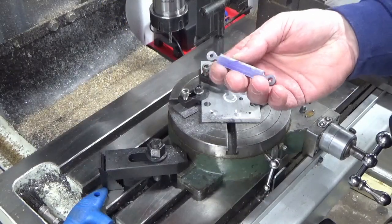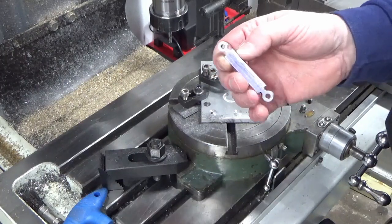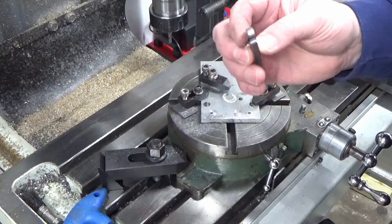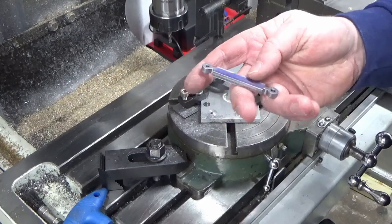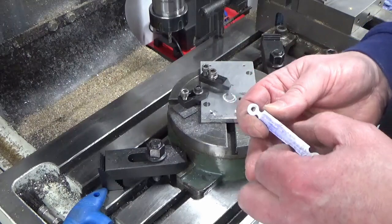There we go, that's got our Conrod ends done. The big end and the small end, and they're slightly different diameters, both of them. So a bit of tidying up to do, but reasonable surface finish, just needs a tiny bit of a polish for cosmetics. So the next job now is we'll get this into the vise and we'll get the middle section wasted away.